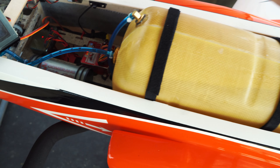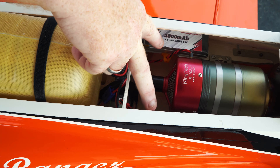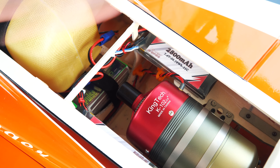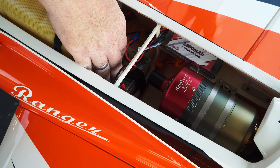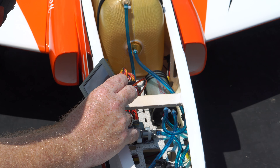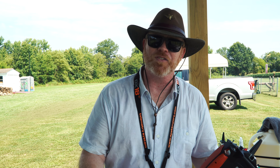You also have several battery packs for redundancy. We have two flight packs — 2800 milliamp — and those are dual redundant for our receiver and servo setup. Although they both draw down, if one fails the other will pick up without a hiccup and still be able to fly the model. The third battery is just for the turbine alone — that's the pulse pack. It runs our GSU and turbine control unit, giving us the power we need to start the engine and keep it running in flight. There's a lot more involved with the electronics inside.